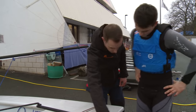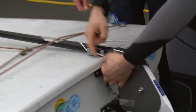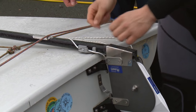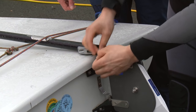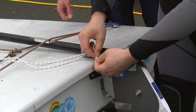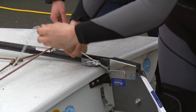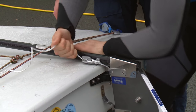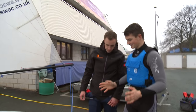Can I put a purchase system in here? Yes, you're allowed to put a purchase system — you're allowed to tie like a slip knot in the rope. So you tie it like that and then loop it around here, really get it tight, and then back through itself. Then you can really jam it on and pull it in the cleat, and that'll make sure it stays completely down all the time whilst sailing.